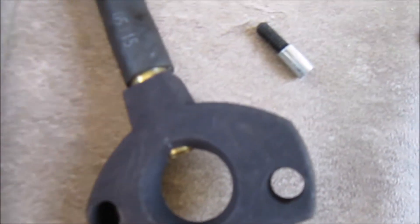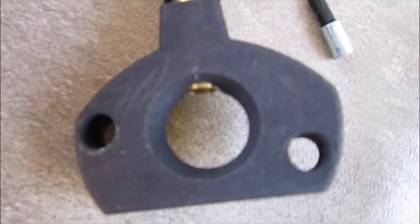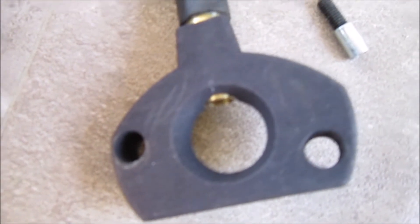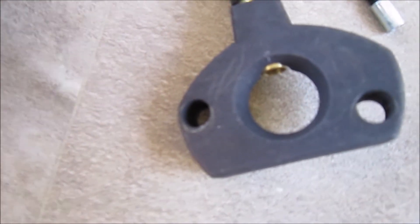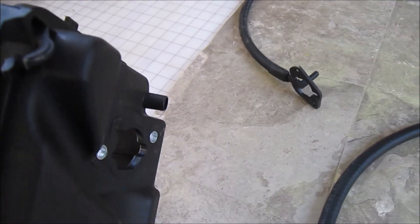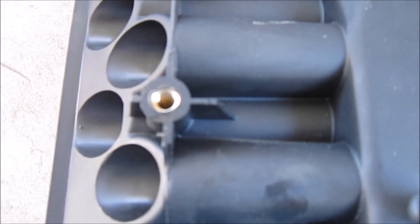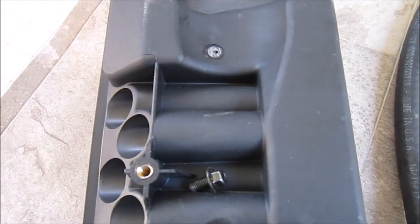The threaded couplers are too short - just kind of a mess. I'm going to try to get some full-sized ones. The other big problem: if you look at the factory gasket, it has cutouts for the air vents, and the Motor Snorkel had them too, but the Nash Fuels venturi does not. I probably need to drill those out to get the carburetor working properly. As you saw, it does run on natural gas with the venturi but it's a little difficult to start - I was disappointed in that. The thickness of the device also pushes it away from the carburetor so the bottom mounting screw is too short.